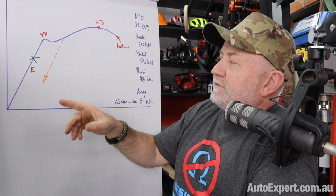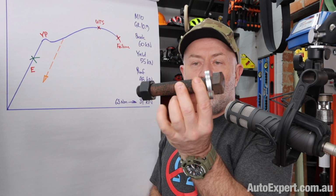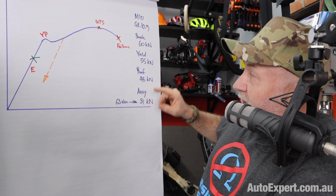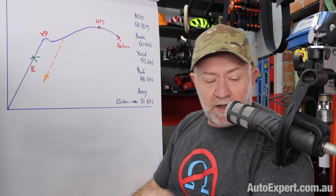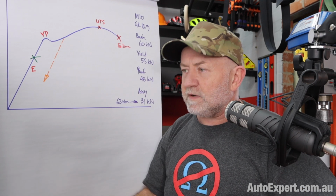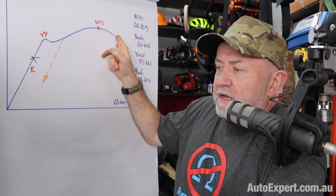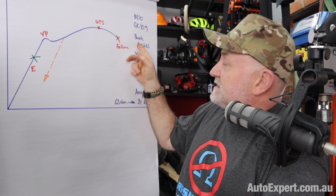Generally, I should run through this in some detail so you get it, okay? If you're dealing with a normal bolt like this, like a high tensile bolt, one that would have been used for donkey's years in various engines, then it kind of works like this. And I've got the numbers here, like a grade 10.9, which is the next spec up from this one. This is 8.8, there's 10.9, there's another one above 10.9, which I can never remember. But basically, when you get to here, you're at 60.3 kilonewtons, okay? It's going to break at 60 kilonewtons.